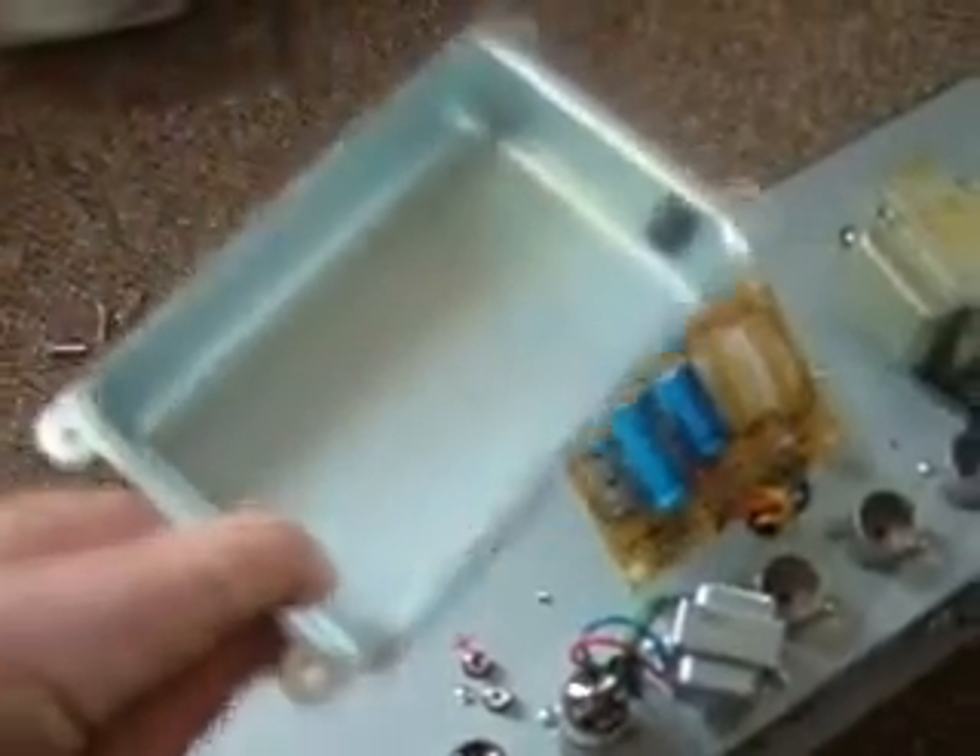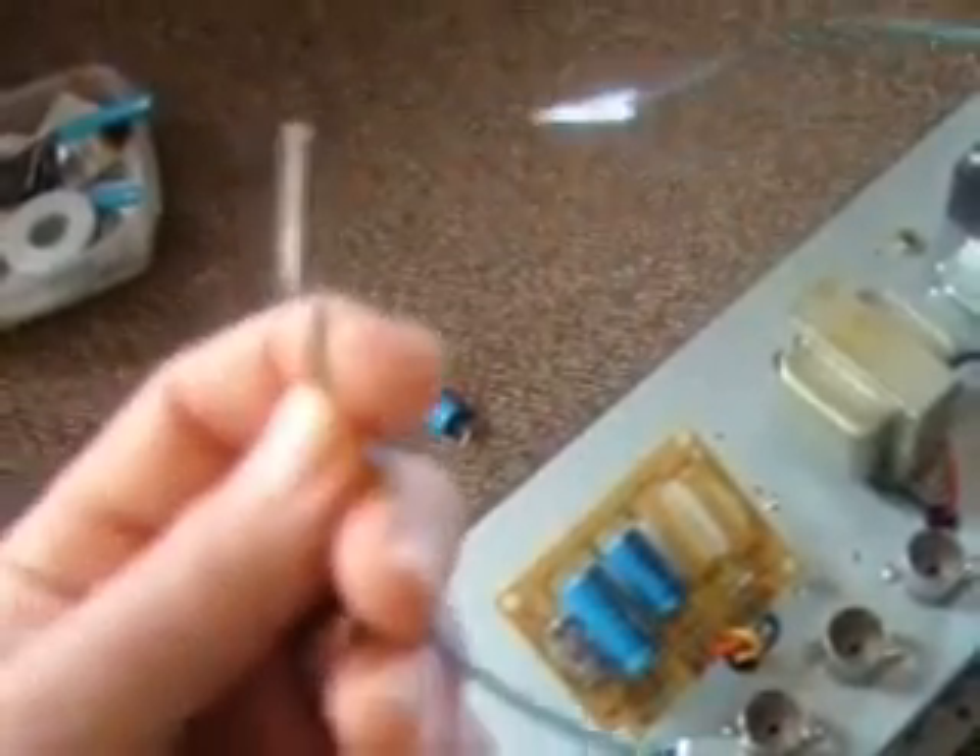These are the caps on my amp. The first thing we did is remove the can. Second thing, very important, is I discharged the caps. I made this thing with a resistor — I think it's a one watt. You don't need the resistor; you can short it straight. It'll make a little bit of an arc. It's a little unsafe, but you can do it straight with a jumper.